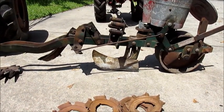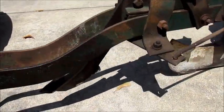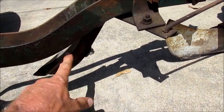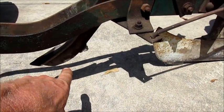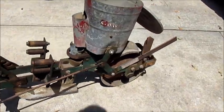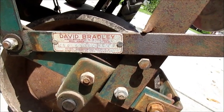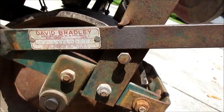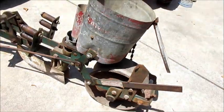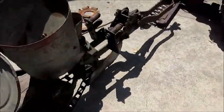You can see it has a large sword which opens a furrow and a heavy packing wheel in the front. It also has a shank in the front, which if you're working in a field that has a lot of trash from a previous crop, will actually cut a furrow before the sword comes through to make the furrow to drop the seed into. The model number on this one is 4545376-0 and the serial number is 1109. This outfit is much more heavy duty than the garden seeder.